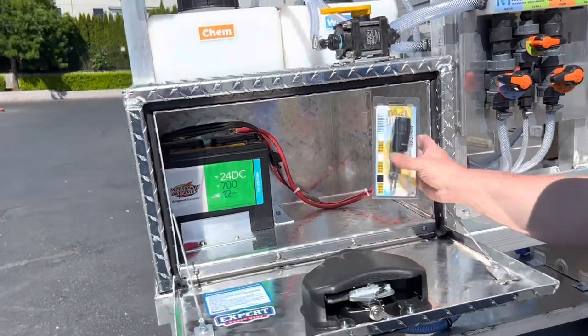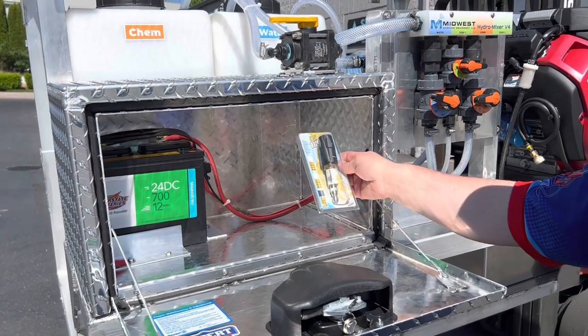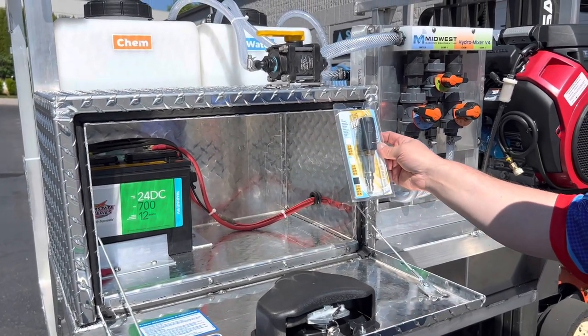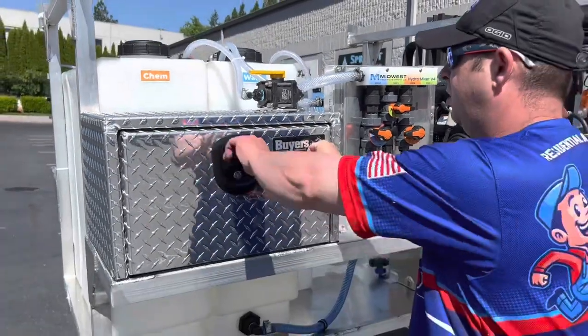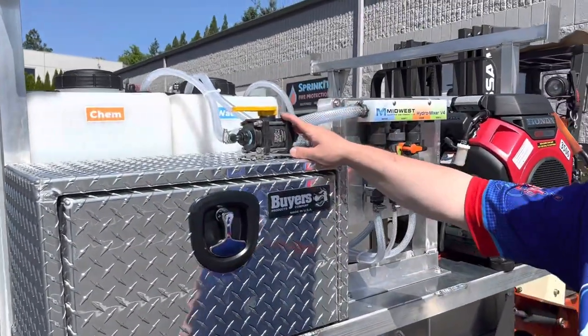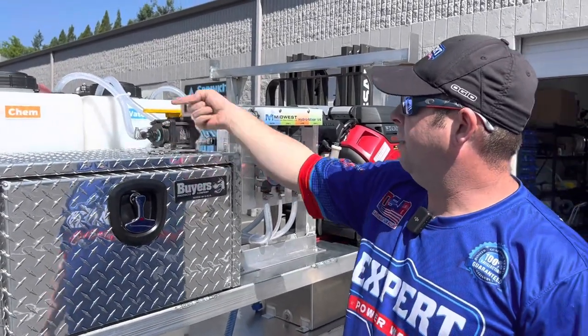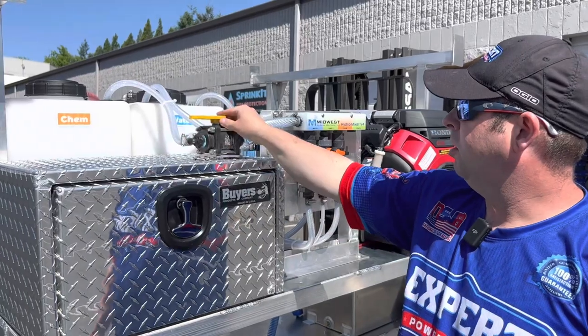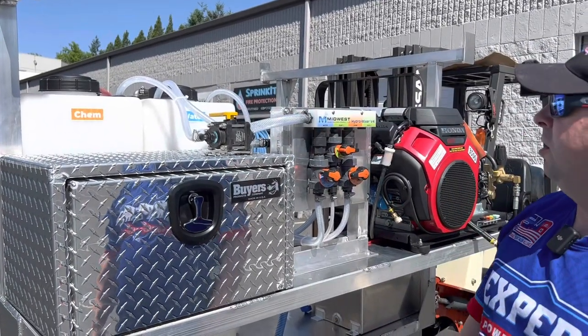This one comes with an M5 twist — this is one of our favorite nozzles to use for downstreaming. They come in a 7 to 12 and then a 3 to 7. Another crucial part that we put on our skids is a bleach rinse valve. If this thing is pointing to the chemical, you're pulling chemical. If it's pointing this way toward the water, you're pulling water.